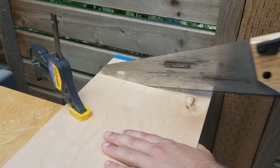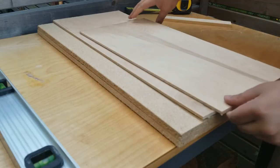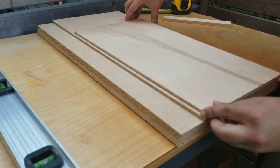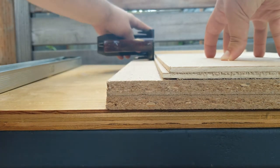I then measured and cut a second piece of plywood with a quarter-inch inset off from that edge. This is so that the blade of the plane won't actually touch the surface while it's being used, as the plane blade will protrude some from it. You can see here how the plane will move up and down the runner while leaving room enough for the blade to move through easily.